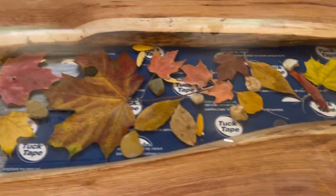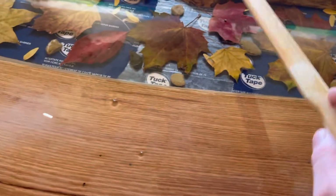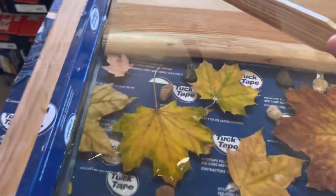Like I said, for the most part, I'm happy with this thing, considering it's the first time I've done any kind of major pour like this. But yeah, to be honest, if I had to do this again, I wouldn't go over the wood like I did. I would just do the river. And I know I came up over the edges. That's the reason I decided to go and do the whole thing. But if I would have just stopped and had the edges, and I wouldn't have had this problem here with these holes, I would have just put lacquer or something over this and it would have been fine. But you live and you learn. So you guys get to learn from my mistakes.